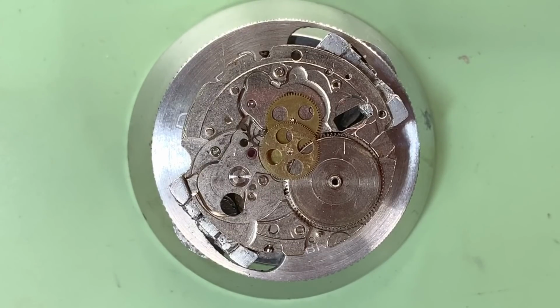Like the black one is the smallest, I think. So get a decent oiler, and then practice on a piece of glass or something where you can see the droplets, and then try and come into the oil well either vertically, and then do the same vertical motion on the piece of glass, and then obviously at a slight angle. Different speeds as well into the oil well will give you different amounts on the oiler itself. So you can practice all this and then try and get it into your memory, so when you do come to oil you've got a good idea.